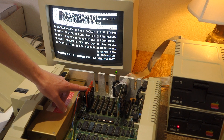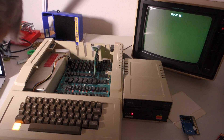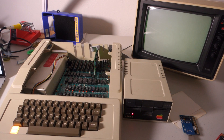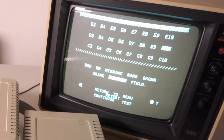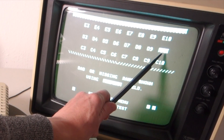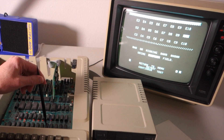The Saturn card seems like it's working fine. To test out Javier's motherboard, I've taken the power supply and the keyboard out of my computer. Let's go ahead and run the Apple II Plus diagnostics on this computer and see if that tells us what might be going on with it. I'll try the motherboard RAM test first. This looks like it's saying that one of the RAMs is actually bad, and it's at location D10 — so that would be row D, and that's the last RAM over here. So let's go ahead and swap that out and see if that makes a difference.